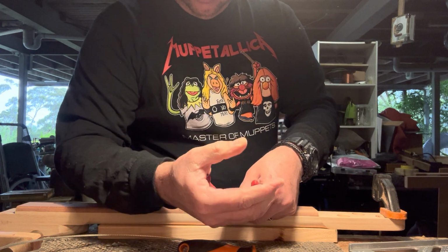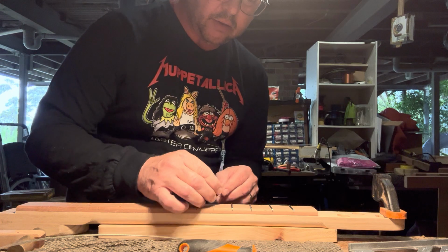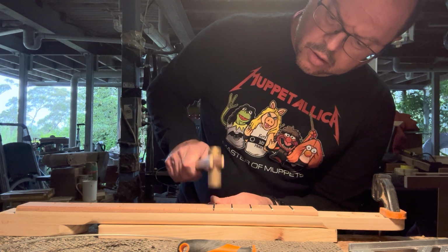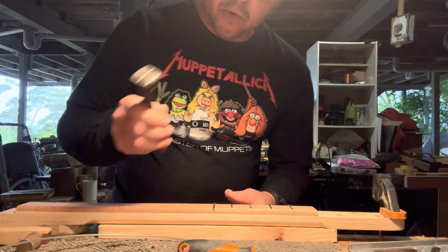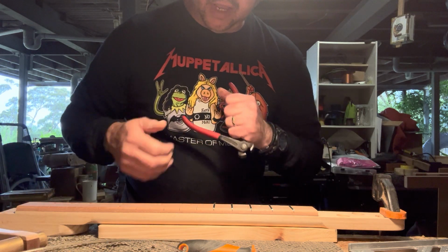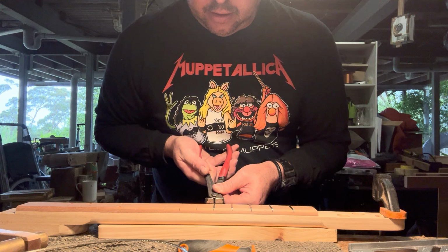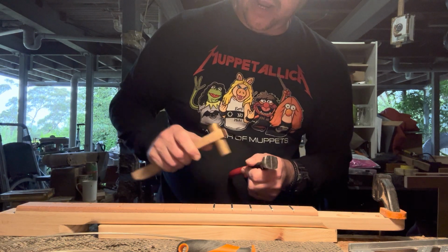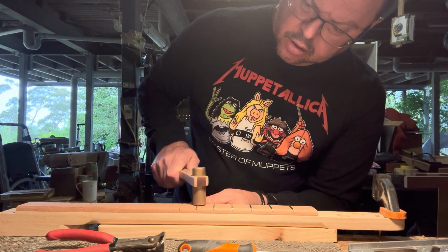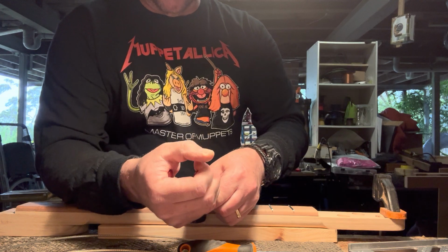Now, a lot of us cigar box guitar builders tend to use timbers which are not traditionally used for fretboards. Some timber can be a little softer, some timber can be a little harder. You need to judge it. And the thing that you might need to do is vary your attack on the hammer, okay? If you're hitting it too hard, you don't want the fret to sink into the timber. Your fret wire is very hard. And the timber that you're using, I'm currently using Meranti, which is a very similar consistency to mahogany.